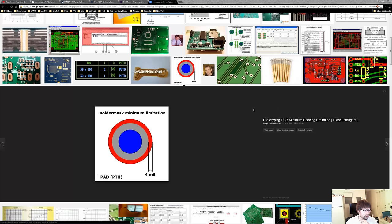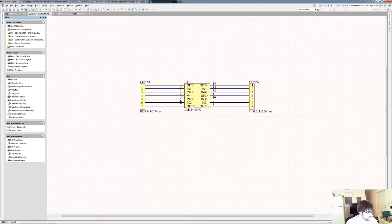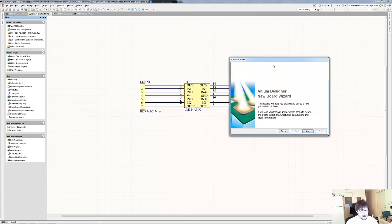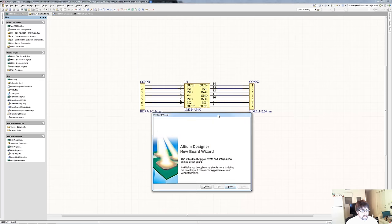Kind of like the component wizard for the PCB footprints, Altium also has a wizard to easily make PCBs to the dimensions and specifications that you want. To do that we use the Board Wizard. Since this is going to be a breakout board, we need it to be a size that when we put the headers on it, it'll easily fit into a breadboard, because we want to be in a DIP package. That means the size needs to be in increments of 0.1 inches, or 100 mil. Let's go through here and make it a custom size rectangle.